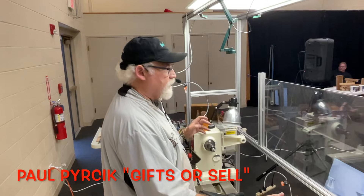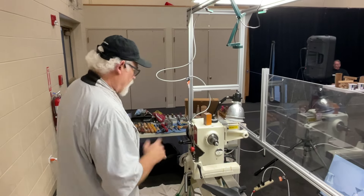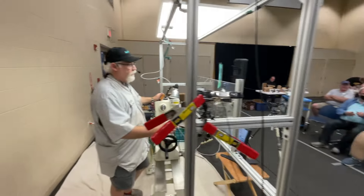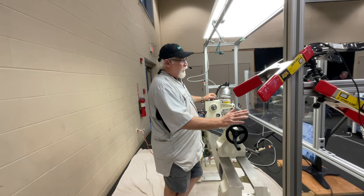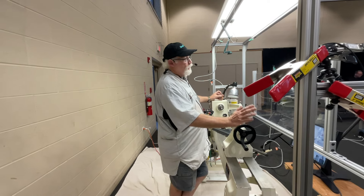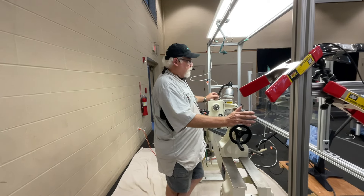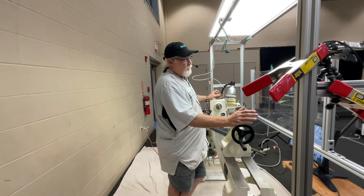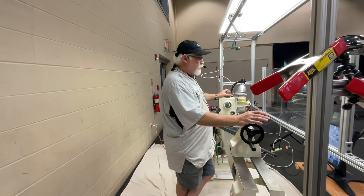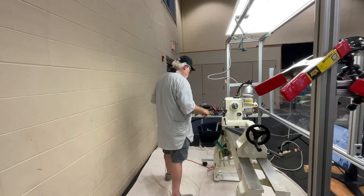Today I'm going to show a couple of things the way I do them. I'm going to do one of my signature wine stoppers in the shape of a mushroom. When you're choosing to turn and drilling a hole, my suggestion is when you use different kits from different manufacturers or bottle stoppers, pay real close attention to their recommended drill size because it does make a difference. Some are slightly bigger, some are slightly smaller. You can use the same approach when making handles — I have a couple of pizza cutters with turned handles on the show-and-tell table.